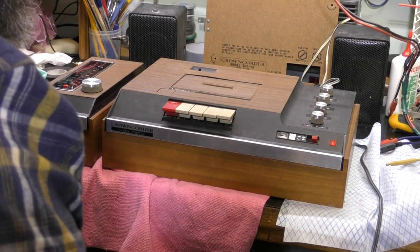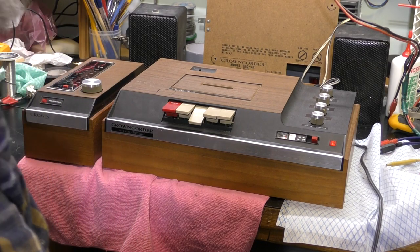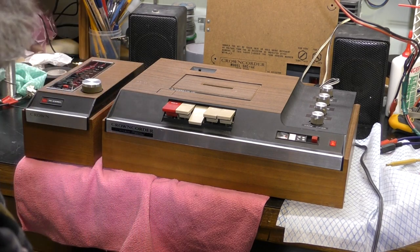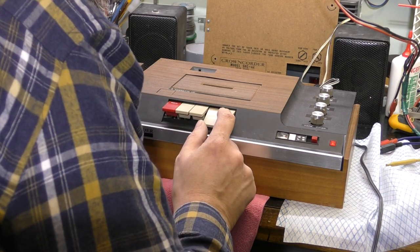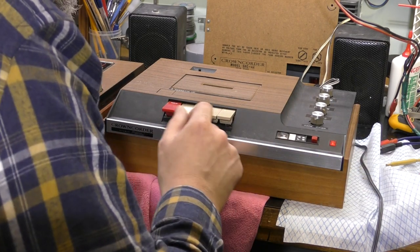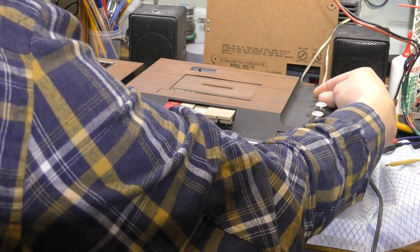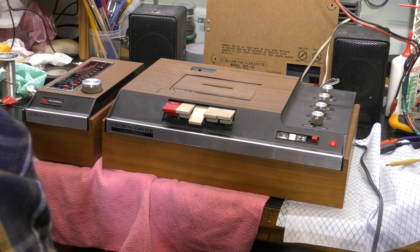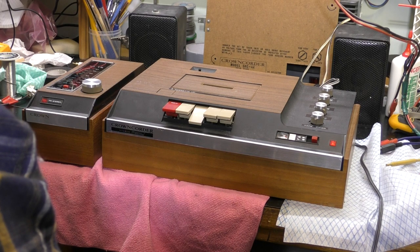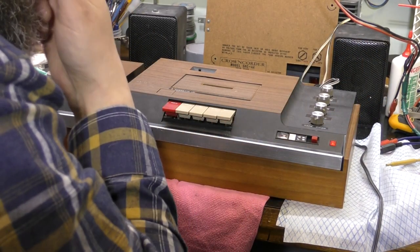Okay, so I've brought the power up now. There is some life in the cassette recorder though — I'm just watching it because the front spool has stalled a few times due to the loose belt. Rewind and fast forward are not very enthusiastic, again because of the belt. Right channel... left channel. Well, it could be a dirty head or a head problem, or perhaps electronics, but that's very very faint — so we know the left channel is not so good.